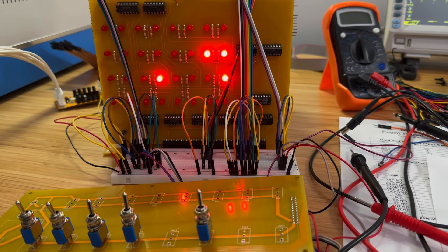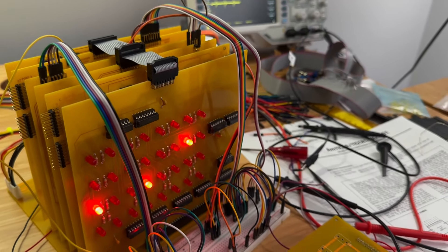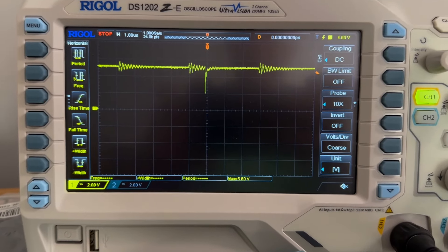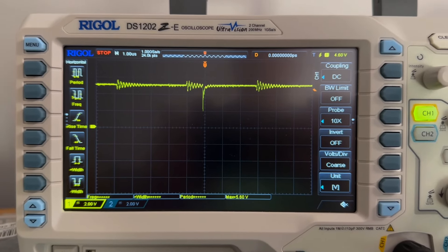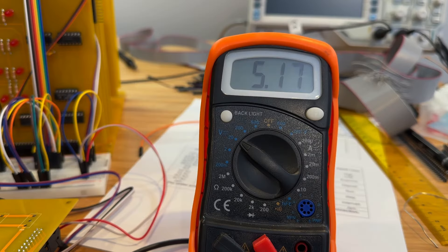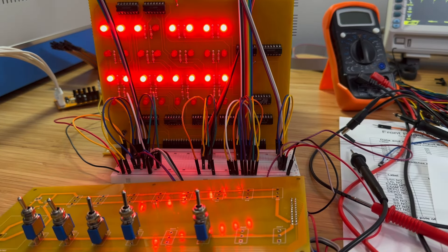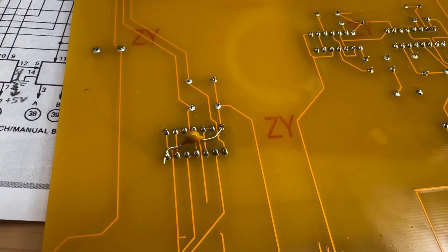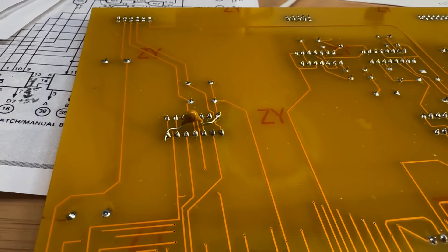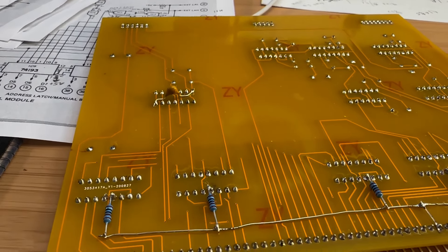Since we cannot continue with the test procedures due to missing RAM, let's try to figure out why load address high and load address low are both toggling each other. My first thought is that ICs might be experiencing a voltage drop going under the minimum voltage threshold. I tested the voltages and I do see a spike when the switches are toggled. Let's try increasing the voltage slightly to see if it makes a difference — and also installing decoupling capacitors right on the ICs. It looks like the Mark 8 is missing a few of these capacitors. Even with decoupling capacitors, it does not seem to fix the issue, although I'll leave these capacitors there as they won't hurt anything.